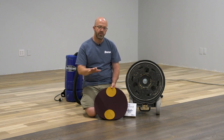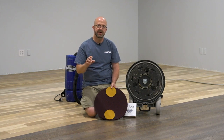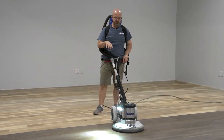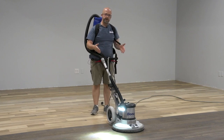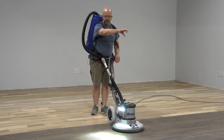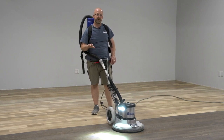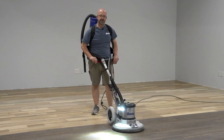The main reasons for abrading are: one, to smooth the floor; but really to bring out issues that might be hard to find and see. We want those to show up with our wet tack so we can take care of them now. A couple of things before turning the buffer on: remember we're just trying to lightly blend the top, so run the buffer where it's floating. Also remember where your cut point is — more towards the back — and your lighter feathering point is towards the front. Run the machine back and forth in a backwards motion, and don't try to heel it.